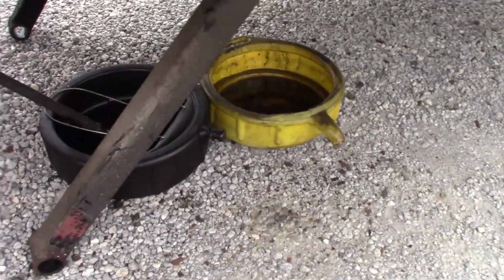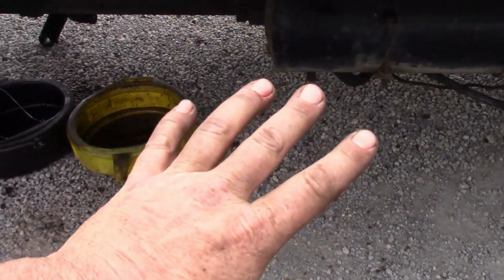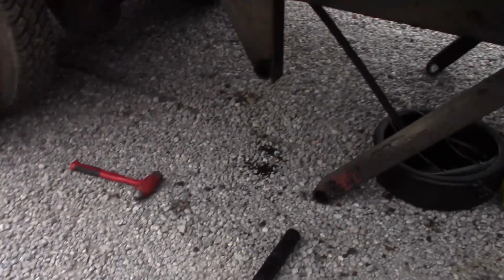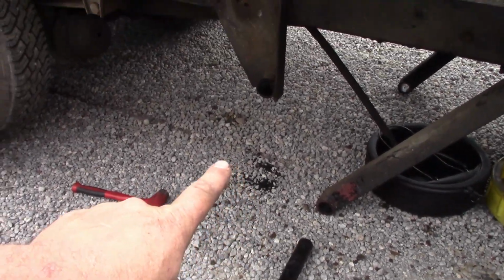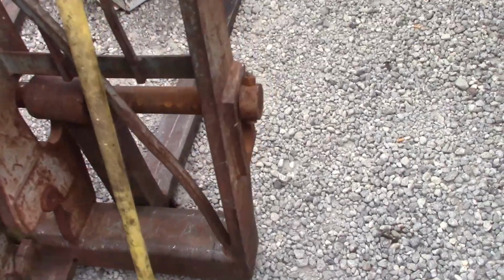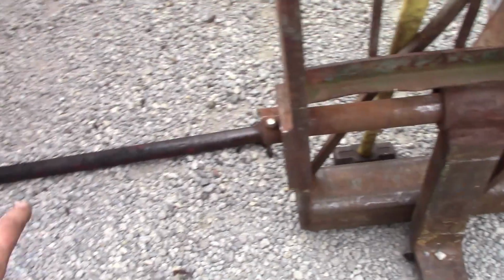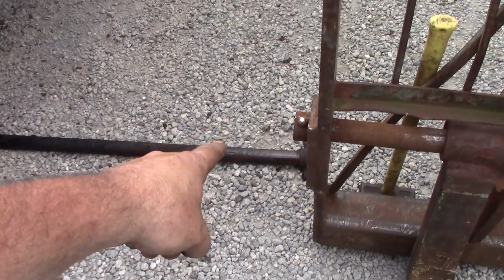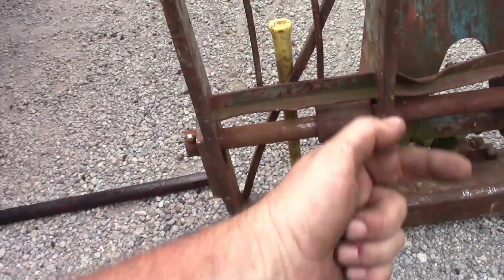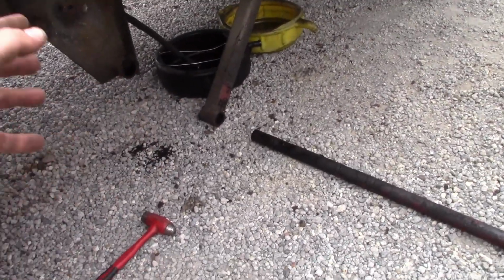All right, the hydraulics are drained. Pressure line will not come off the back of the pump, so I took it loose from the valving. Not ideal, but it'll be fine. I just pulled this pin out. It goes from one bracket clear over to the other side to the other bracket and through these arms. It wouldn't come out, so I brought the grate all over and I put a ratchet binder around that pin, hooked it to that side of the carriage, and just tried to drive it out while I was beating on the arms to shake it loose, and it came out.